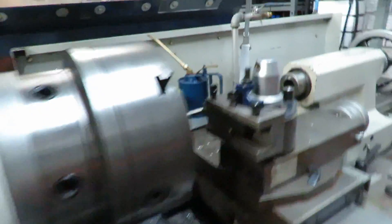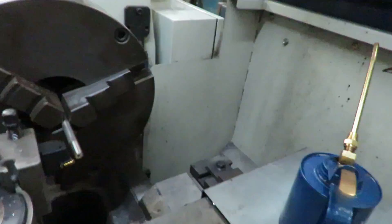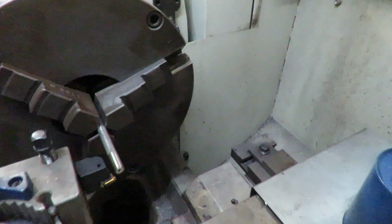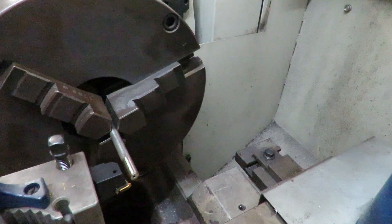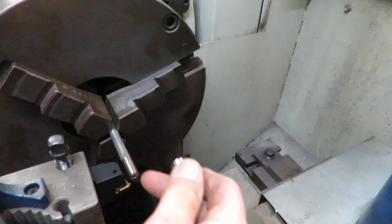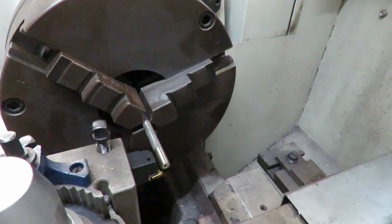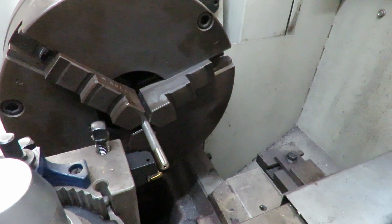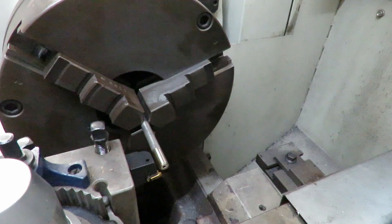So this is one piece of it. It's from a water jet machine that blows out tube. We're busy now going to make the thread on the other end of this tube — they had a longer tube. We've set everything up, got it all ready. This is 24 TPI and we've already done most of the machining. I've already set it up to do the cutting, so we're now basically on the spring cut — maybe another one or two, then a bit of a cleanup, check it, and if all good then all we've got to do is make the final taper here.